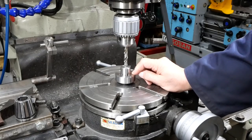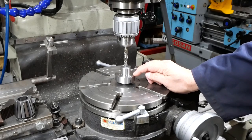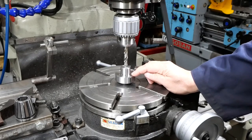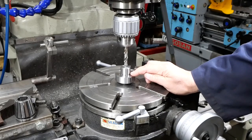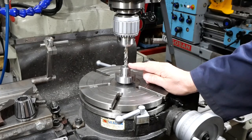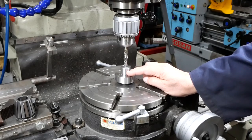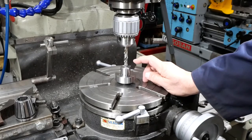Moved over to the rotary table now to drill and tap the hole in the nose here. The rotary table is in fact what this arbor is intended for, as you will see in another project. The reason I didn't drill and tap the hole in the lathe is that with that setup, this was just pressed into a sleeve with no draw bolt to hold it in place. If the drill catches it could pull on the shank and release the taper. In this setup I've actually got a draw bolt fitted on the backside, so it isn't possible for that to happen. Also, concentricity isn't really that much of an issue for this hole and the thread, because the location of the cutting head onto this arbor is on this diameter. The threaded hole plays no role in the alignment - it's just a securing feature. That's why I'm doing it in the rotary table.